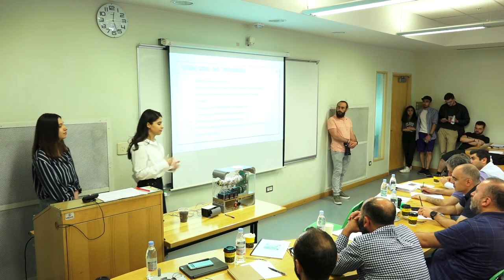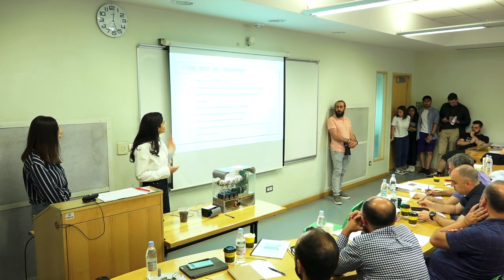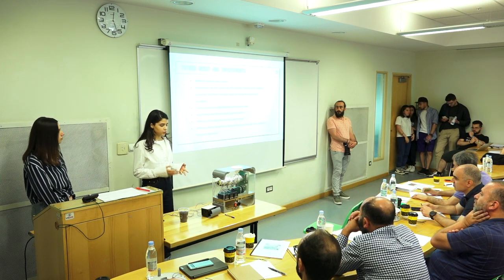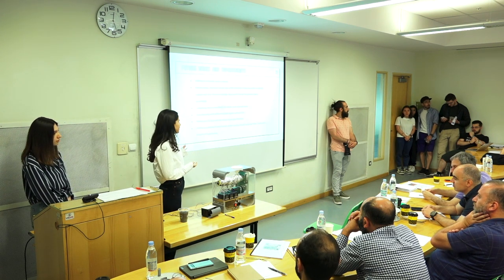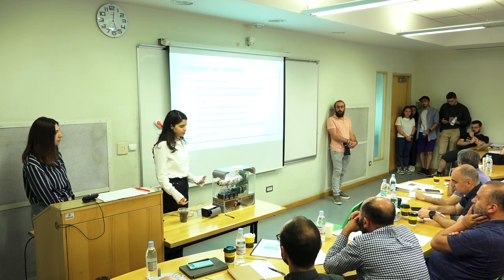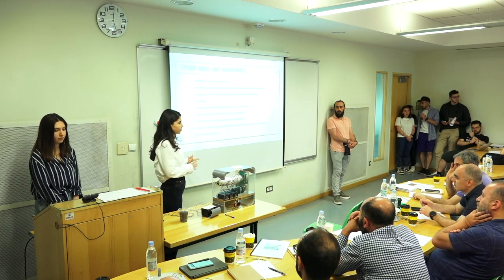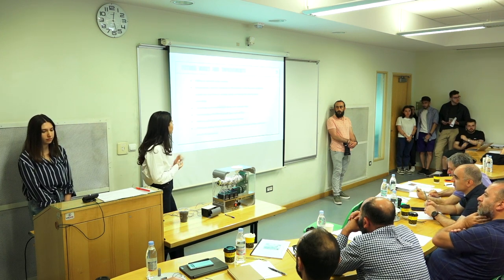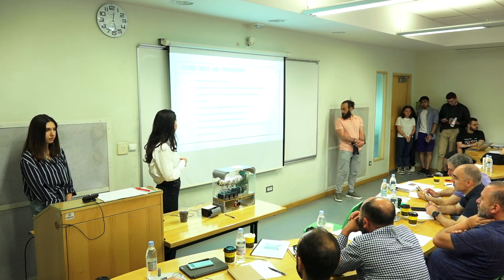So now let's get to the conclusion. Actually, there are future works and improvements that can be done to make our device better. The most important one is adding an automatic puller module, because our results ensured high quality, but as we did the spooling and pulling manually, we didn't get a constant diameter. Adding a puller module can solve this problem, and the device can provide high quality filament with a constant 1.75 millimeter diameter. Also, a sensor can be incorporated with a PID controller inside the puller module to get feedback about the diameter of the filament.